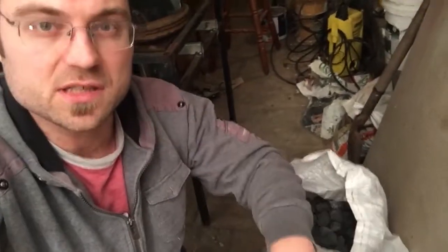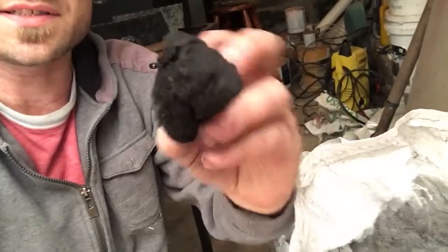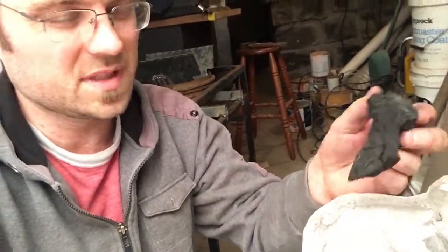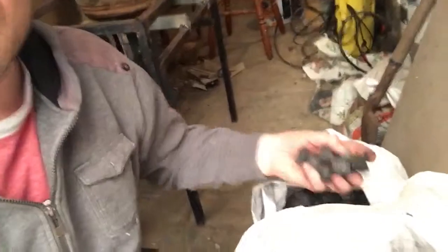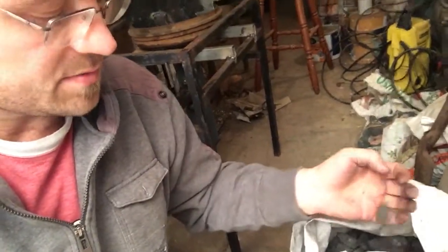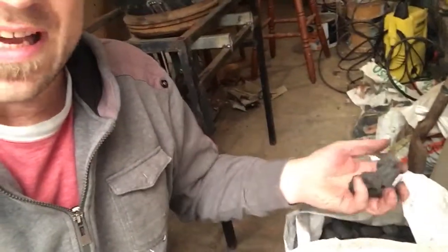So to start the fire, I've got some newspaper and I've got charcoal here. See if you can see that. Charcoal, pretty large pieces, so I'll have to break that up into much smaller pieces. I've been told, you know, 20-cent piece type sizes that we need to actually get that to catch a light. And the other is that I've got some coal, sorry, not coal, coke here. And as I said in the previous video, we'll need to get a bit of air on that and get some real heat on that for it to really heat up.